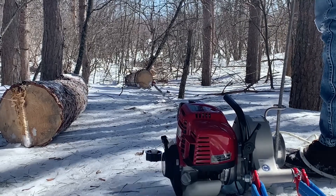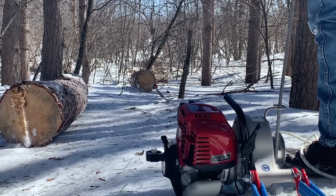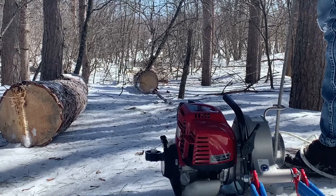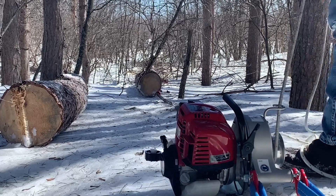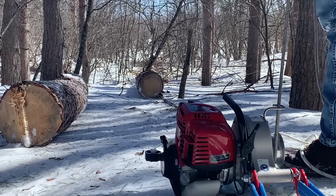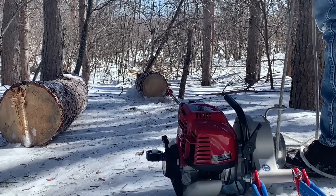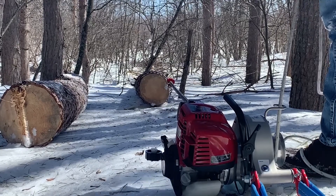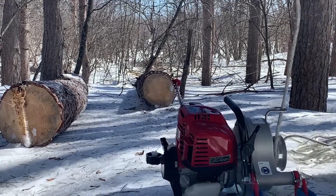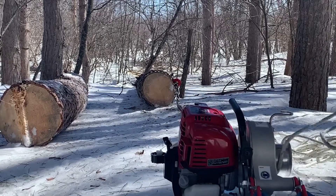It's sure nice not having to deal with cables and unspooling cables from a drum — they come off like slinkies or heavy chains. I use about a six-foot length of choker chain on the end, but the rest is rope. This model has 165 feet of rope, and because it doesn't spool on a drum, the first foot has as much pull as the last foot. It's not like a regular winch. Also, it's so light and easy to walk through the woods with.